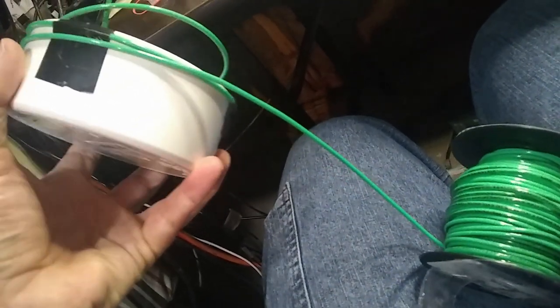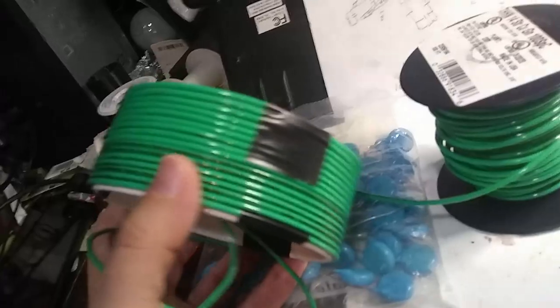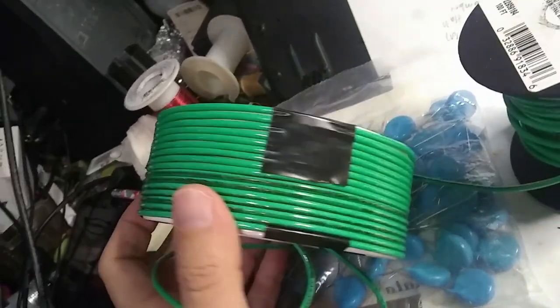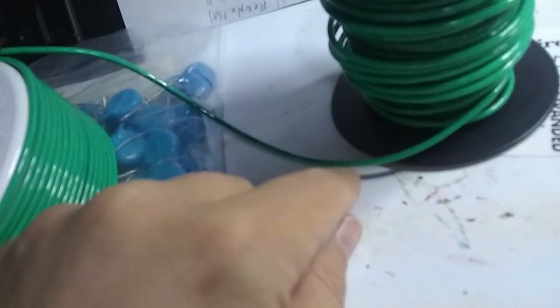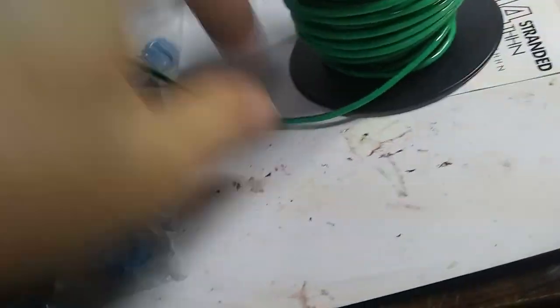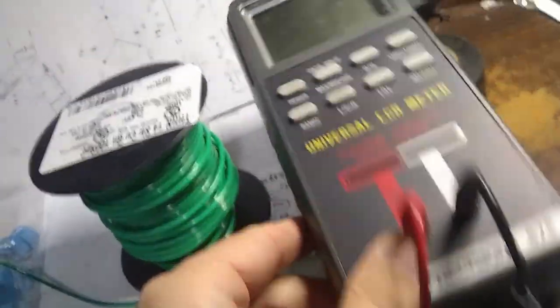Handy-dandy lap coil winder — I'm going to tighten these up. That looks like the coil is coming along pretty nicely. I think I finished the windings and we have 17 on there. I put some tape on the bottom to hold it in place. If it looks good, I'm going to wrap tape around the equatorial direction because that makes it a lot stronger. I'm going to find a pin and stick it into the wire so I don't have to cut it — the pin will be conductive and go through the insulation, making just a small hole. That way we can measure without cutting, and if we need to add more windings, we can.